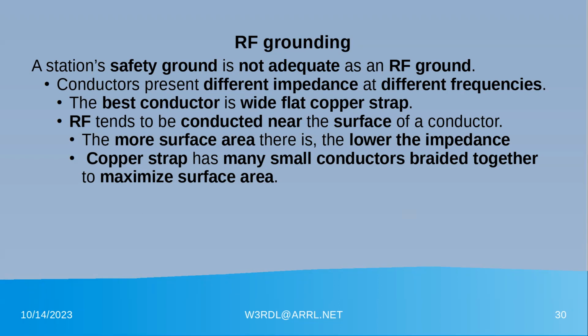It's magic. Okay, but wait, so you add inductance initially because you have to add the loading coil. And without the loading coil, you've got more capacitance. So the loading coil is offsetting the capacitance with more inductance, right? And it overcompensates, so we have to add more capacitance on the top, so that they can be resonant. That's the reason we have the loading coil, because the electrically short antenna becomes capacitive. Remember, resonant is inductive reactance and capacitive reactance nulling out.